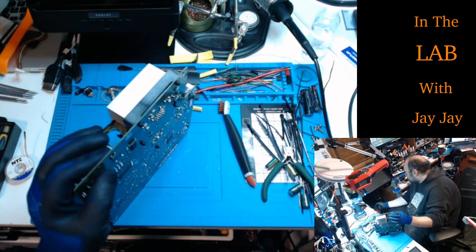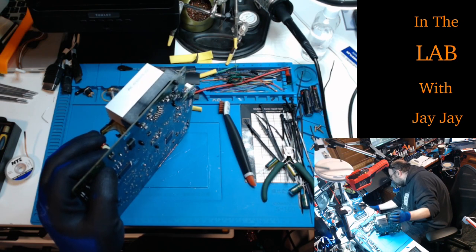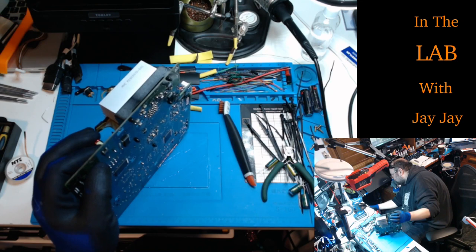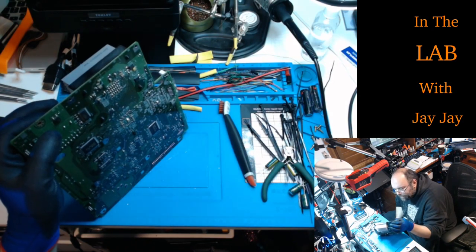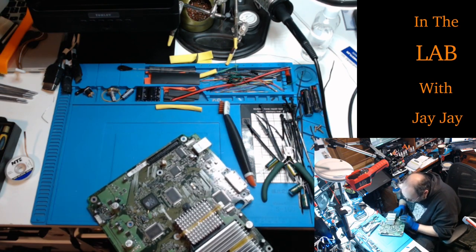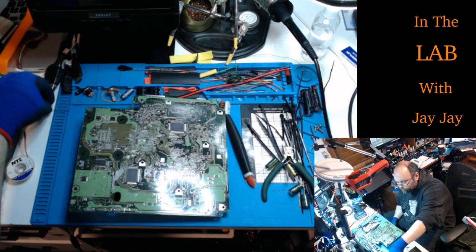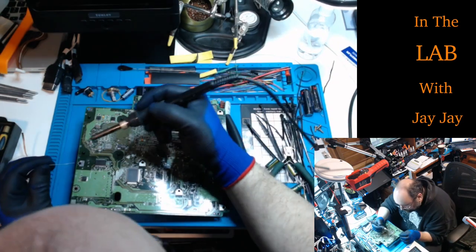Well, I'm gonna be brave and put this up to, let's say, 375. I don't want to go over 380 because I've heard that can damage tips and the actual tip melts. I'm gonna add some solder and see if that is a technique that's useful at all.